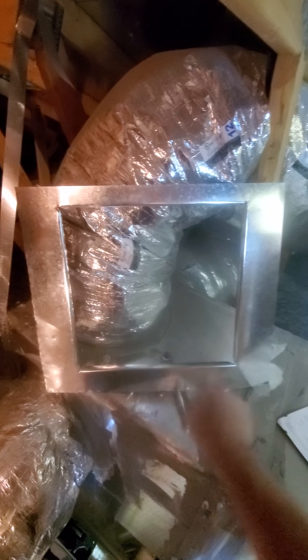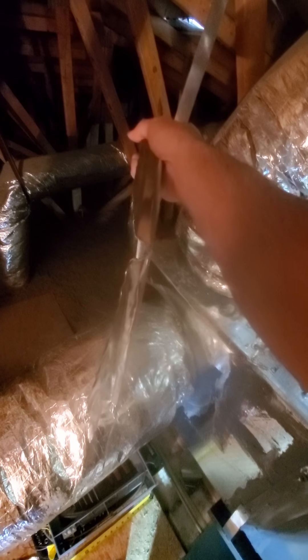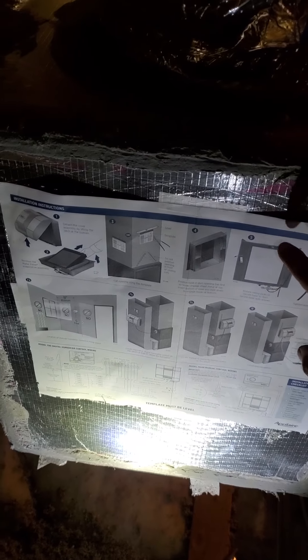Let's get down to the nitty gritty. I took a piece of galvanized sheet metal for HVAC systems from Lowe's, put the template on it, traced it out, and then instead of straight cutting a hole out of the center, I drilled each corner and the center and cut diagonally across it so that I could create a channel to go up over the fiberboard. I bent the flaps back, cut them all flush with the edges, and bent those over to make a little shelf to kind of get the shape of this ridge. That's what I'm going to put in the back of this. Now I've got my template up here, leveled it out, and cut it out with a utility knife.